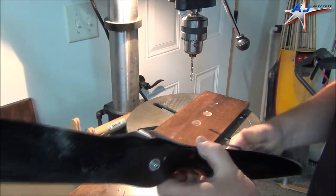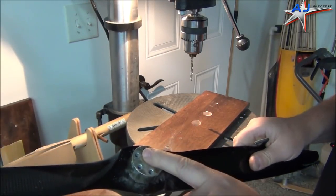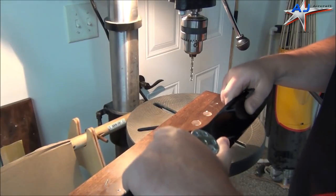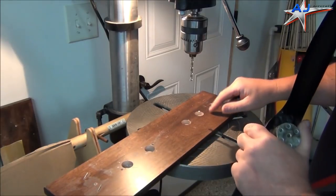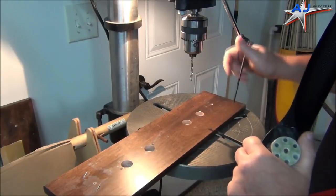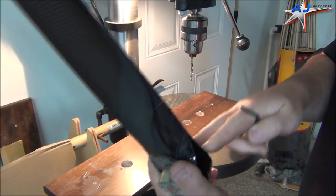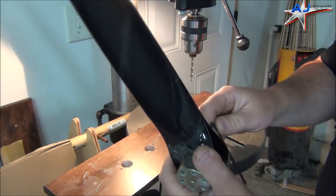So as you saw, we drilled one through and we drilled the rest through approximately half. You'll also notice that while I was drilling the five halfway through, I didn't move the prop on the spoil board at all — we just moved that around as a unit. If you are constantly moving this and picking it up, you're going to get some of that shaving dust in between and potentially screw things up. So you definitely want to try to keep that tight to the spoil board as long as possible during the drilling.